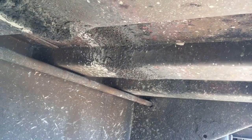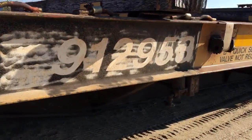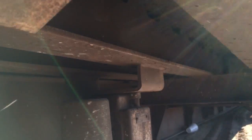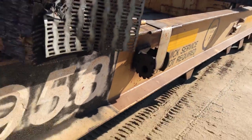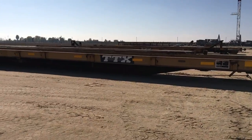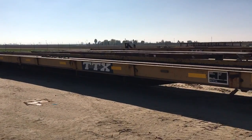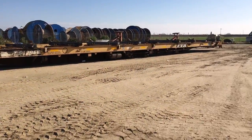Also, if you look up, this car has a whole bunch of latitudinal or transverse cross members all the way down, at least for this part of the car. After the first cross member here, it has a bunch of WTs - three WTs to be exact. So this car and the first car are quite different: one has a whole bunch of kickers with two U's for longitudinals, the other has only a few kickers with triple WTs for longitudinals.